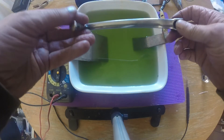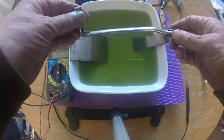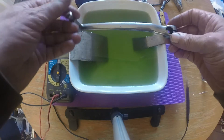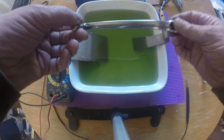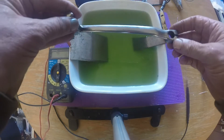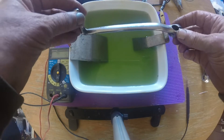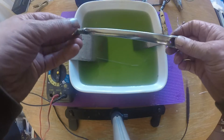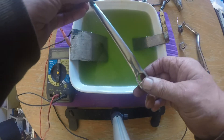One important thing is that parts have to be really, really clean. You should be quite scrupulous about cleaning your parts — give them a really good clean and de-grease them. If you want to go the whole hog, you can get alkaline cleaners, acid etch and all that sort of stuff. I just give them a good rub down with white vinegar, and that seems to do the trick for me.